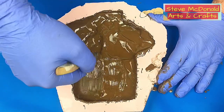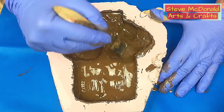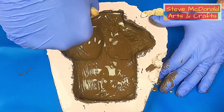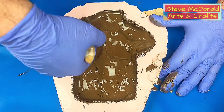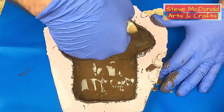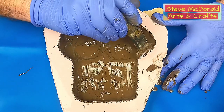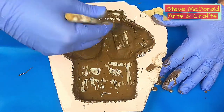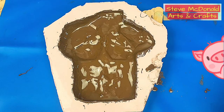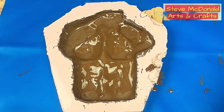The resin is now really thick and gel-like. I'm doing my last brush-over, pushing it up to the edges, and that's it. The reason we don't fill the entire mould with bronze resin is twofold: bronze is very heavy, and it's also not cheap — so why use it to fill an area you'll never see? You'll still get exactly the same great bronze-casting results.